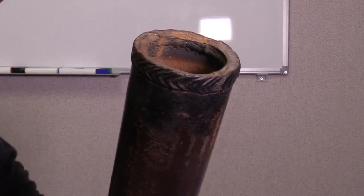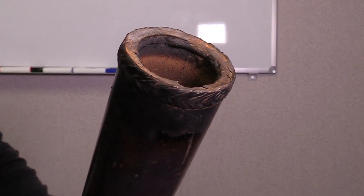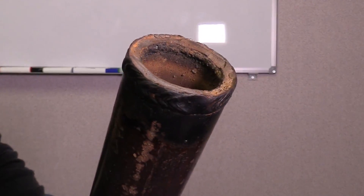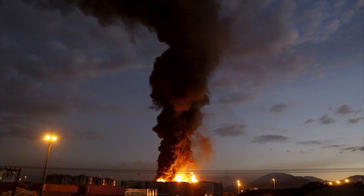It's very rare to have a weld break 360 degrees all the way around — I've seen thousands of cracks but very rarely have I seen one break like this. At only 200 pounds of pressure this weld broke apart completely with devastating consequences, because material had been substituted that the welding procedure did not cover, and this is a common problem that happens all the time.